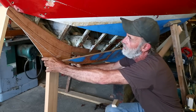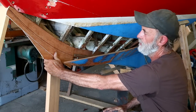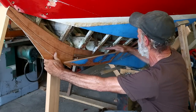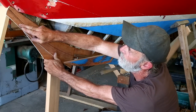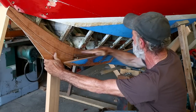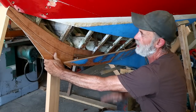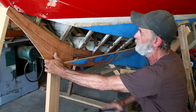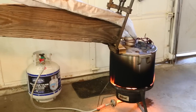That is the timber we're going to make. There's a curvature to this pattern and that curvature has to get transferred onto a mold that we're going to bend our piece of wood over. We're actually going to bend a piece of oak to this shape, and the reason for that is so we won't have any grain going diagonally across the timber — because it would be vulnerable to breaking anywhere that grain slices across in an odd way. We're going to transfer the pattern off onto a mold to bend our piece of wood over, and we're going over to where we're steaming it right now.